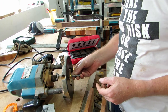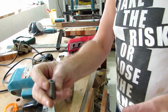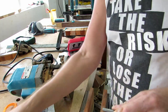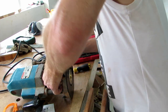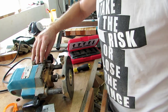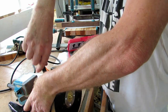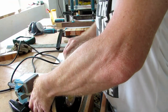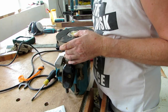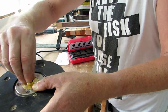Now we put this in here and the screws fit in here, but we won't tighten them yet. This is the centering pin that comes with it — it fits directly into the middle. We need our reducer because this is one quarter inch, not six millimeter. We put this pin in here and tighten it up in the router. This process applies to all routers — they all have a little bit of adjustment in them. You don't want to be doing this with your router bit, so you have this pin here for aligning. Now the pin has come through — do you see it?